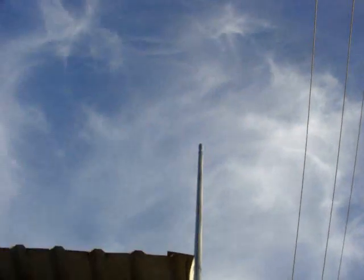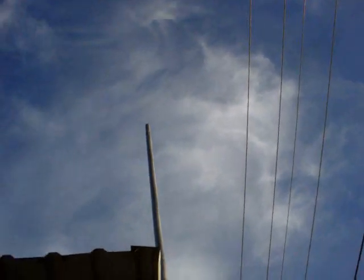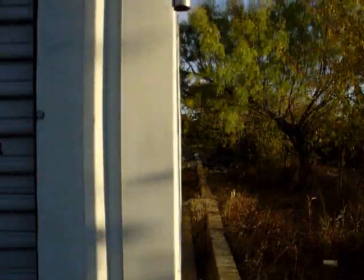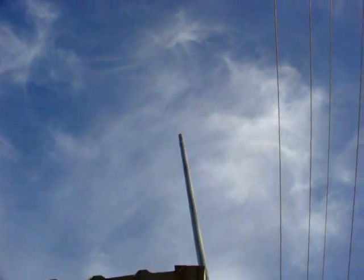And slide on. I've got the other coupling here in my pocket, so I've got to bring the wind turbine up there. I'm not going to bring the camera up there and show you how to do that, but I will put the wire through before I go up, connect those while I'm up there, and the wire should come down here to the bottom. It'll always be very easy to untwist from then on. And I might put some tape over the inside of that pipe up there to protect the wire.